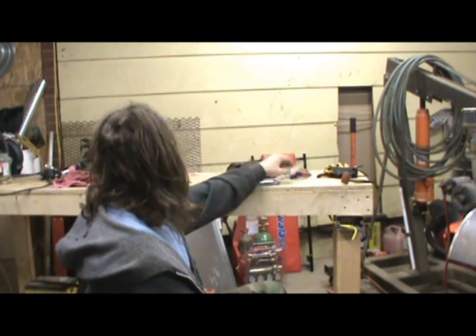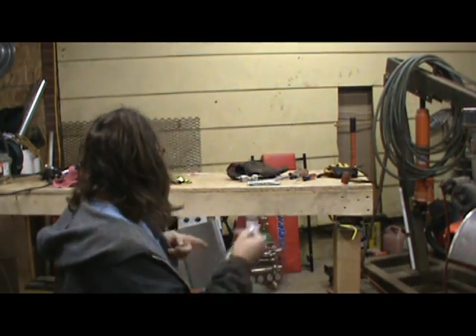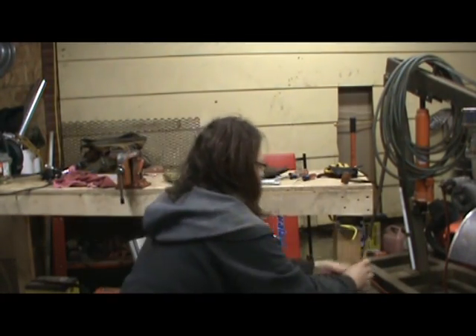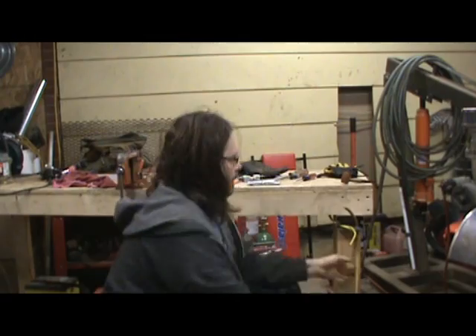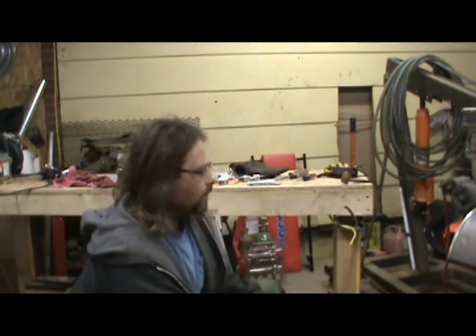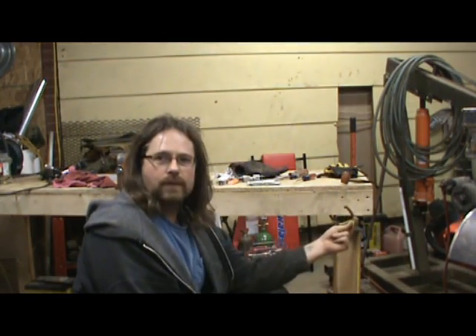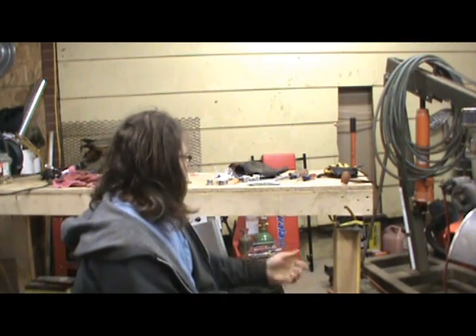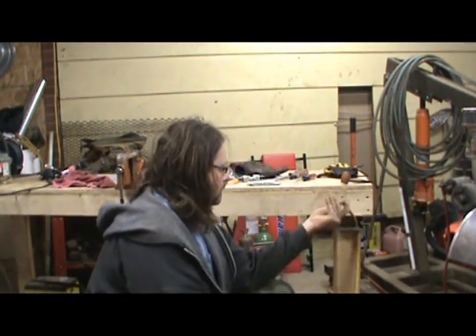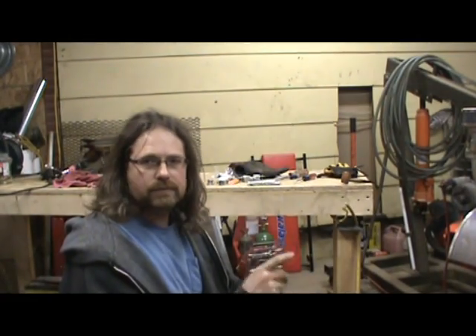Decided to wire it up. I went down to the hardware and picked up some Romex connectors. On my extension cord, I'm just going to put a 15-foot cord on this thing so that when I drag it around, I'm going to bring my extension cord up in here and make a hanger for it — somewhere where it's out of the way. I can roll the cord up when I'm moving or storing the bench. And then I took a regular 12-2 with ground and stapled it on the back side here, in a place where I'll never drill through it. I'll have a receptacle on this end and a receptacle down here so that I can plug in my grinders or lights or whatever I'm working on.